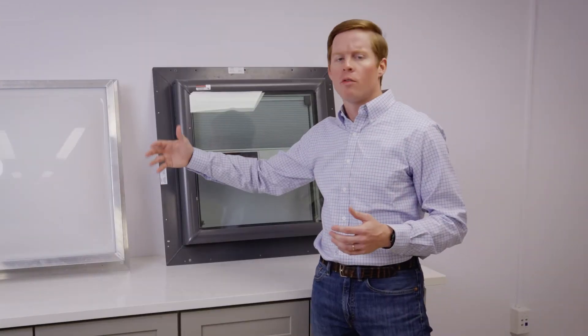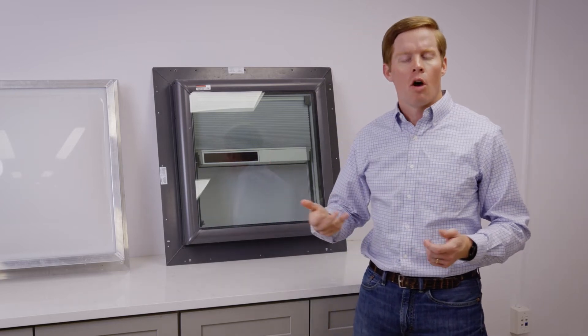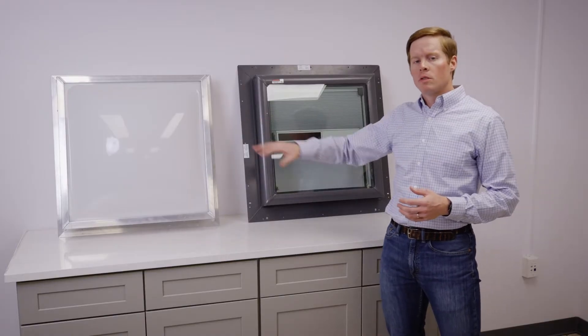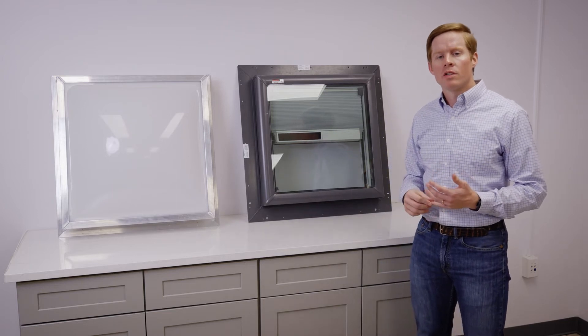The second item that we're going to look at is leaks. The acrylic dome over time does weaken over years of heat exposure. With the Velux flat glass skylight, you have a 10-year hail and a 10-year no-leak warranty. The acrylic domes do not have hail or leak warranties.